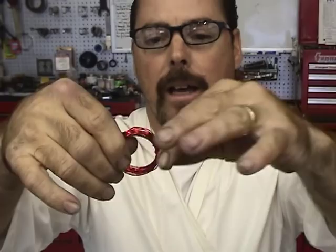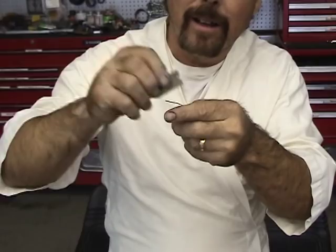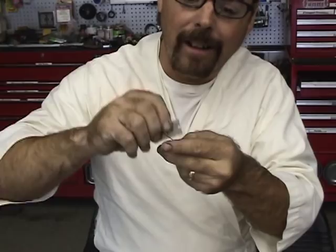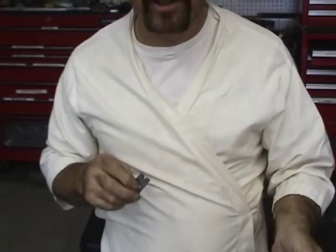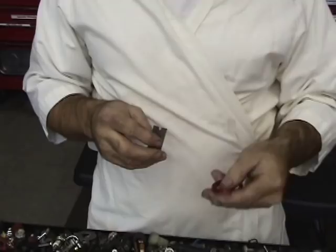See that? Okay. Now, if you got a razor blade, you're gonna wanna scrape off all that insulation. Watch your finger now, you don't wanna cut it off like I did in the video. All right, you're going to get all that insulation off of there. And on the other side, you're going to take it all off except for one side. You're going to leave one side insulated. And there's a reason for that. It'll shut the circuit on and off, on and off. Anyway, go ahead and scrape all that off except for that one side. Actually, I think you could probably scrape it all off since we're working with a monopolar magnet here.